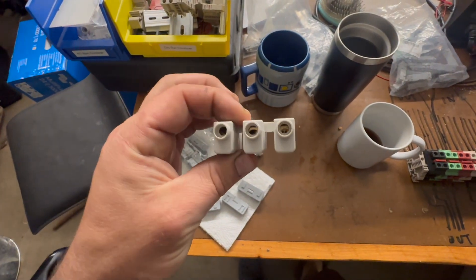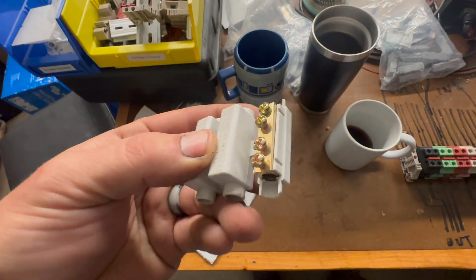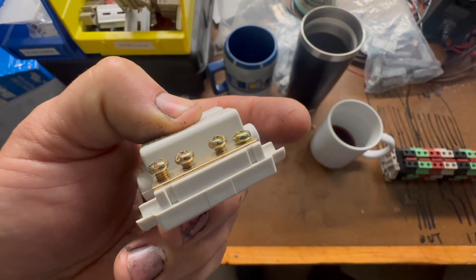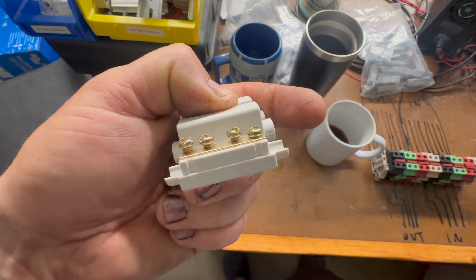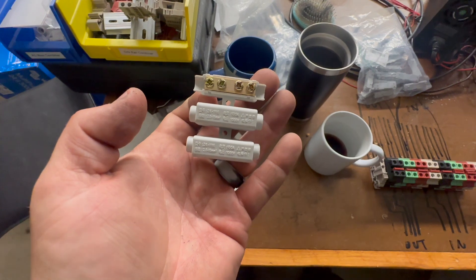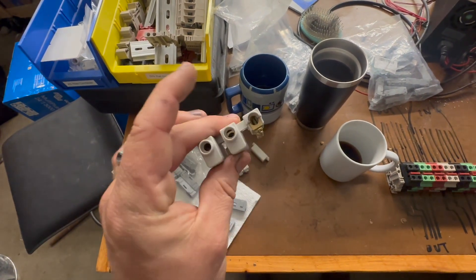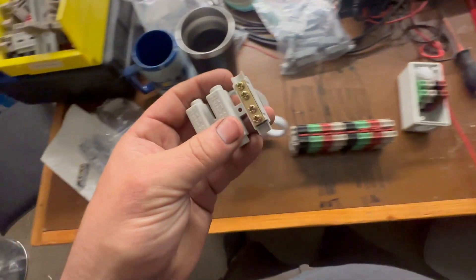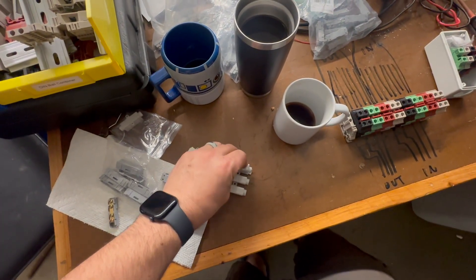This is something I was finding on Alibaba for a while, but I can't find them anymore. So I finally got one of the covers off, and as you can see, you've got a brass terminal block here. I like that it has dual screws, because I have a saying around here: if you have one, you have none — which means if you're relying on just one thing, you're not going to have any if one comes loose. So I like that idea here. What this is for is splicing a 30 amp connection together, like the shore power coming in and then splicing our wire going to the inverter. I like doing this now more than wire nuts. What I like about this is it's fully encapsulated. It's a lot smaller and easier to work with, and it had little screw-down holes — but I can't find these anymore. The manufacturer quit selling them, at least to me. So I'm down to my last couple, so I went on the hunt.